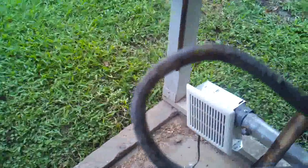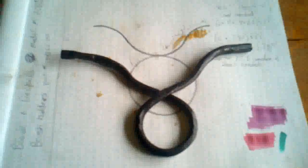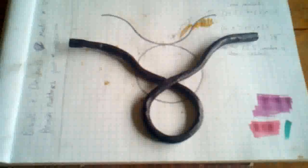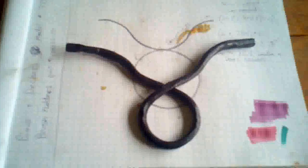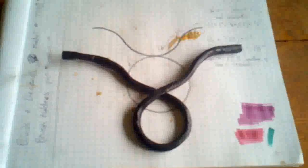Not doing too bad. There you have the finished shape. I've also coated it with wax. Generally you coat blacksmith items with beeswax or a canning wax — even candle wax will work — but I have none of those. So I hit it with a black crayon: I heat it up with a torch and then run the crayon all over it. The wax melts in, gets hard, and gives it a nice shiny finish, but it also protects it from corrosion.